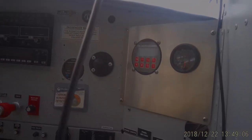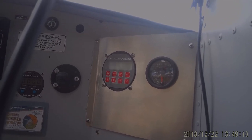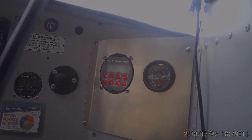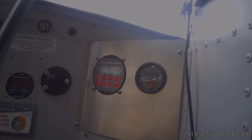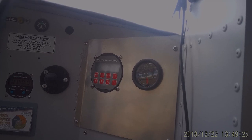You'll see here a couple of gauges — the large circular one with the red buttons on the bottom is the SDS programmable gauge, which gives tremendous flexibility in adjustment for the air-fuel ratio and mixtures. To the right of that is a fuel pressure gauge, very critical to have set correctly for the LS application. I just have a single NAV/COM, transponder, and audio panel. Looking up at the V-brace, we have a much heavier V-brace, and we're also designing another application to attach it directly through the firewall to the engine mount, to give more sturdiness in that area for download movements on hard landings on ground or water.